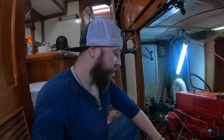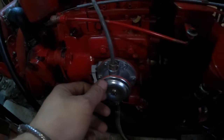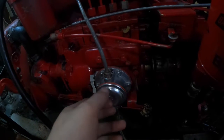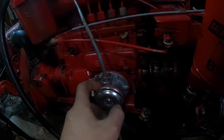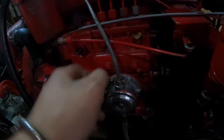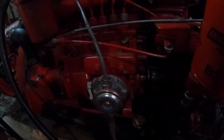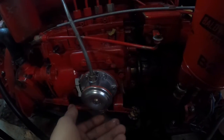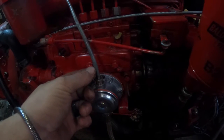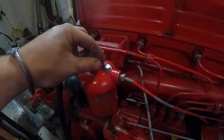So I got the fuel pump installed after I swapped out the plunger arm, but it still wasn't working — when I went to crank it over, it wasn't getting any pressure. What I found is that this top is actually a perfect circle: one line has a one-way valve and the other is another one-way valve, so when the plunger goes it pulls and pushes. This was actually 180 degrees out — and that's not a part I took apart. These Lehmans come in a bunch of different variations, and this pump is actually mounted reversed when it's not on a coupler. So I think this was for one of those configurations.